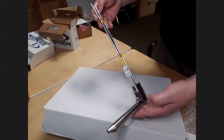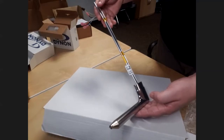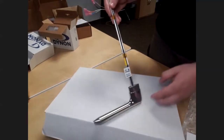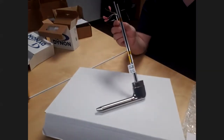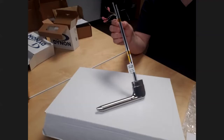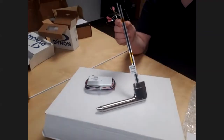And Frank actually liked that best. I need to get a sound sample of it, so every time I describe it on these videos, I can play it. It kind of sounds like a digital Geiger counter, a tone that's just beep, beep, beep, beep, beep, and it increases in frequency until right at your stall, or wherever you have it programmed for your highest angle of attack, it just goes to a solid tone.